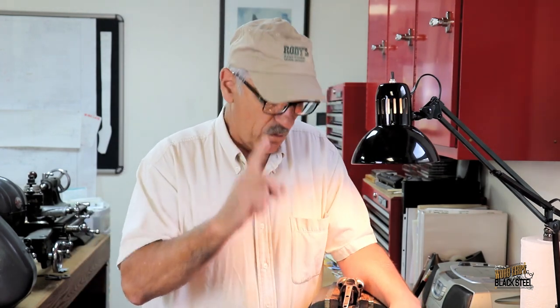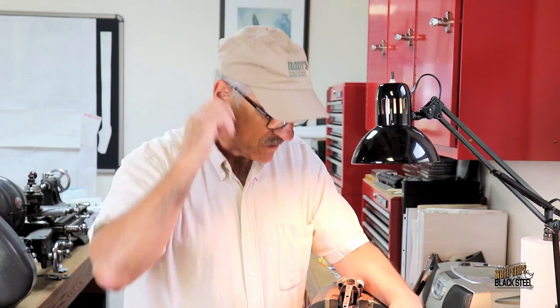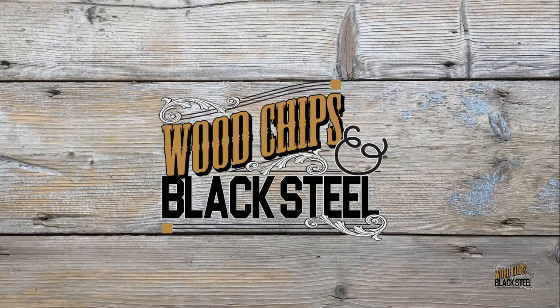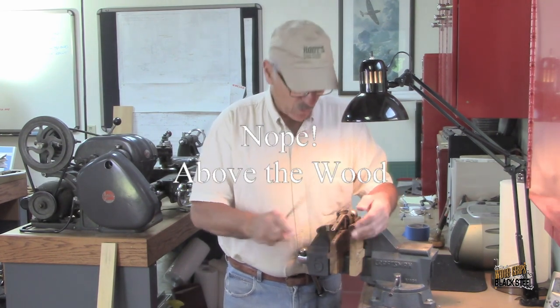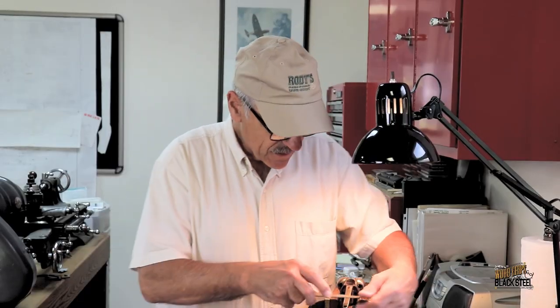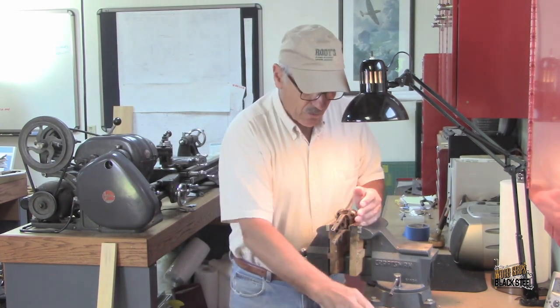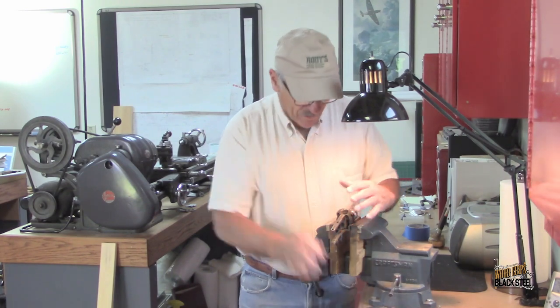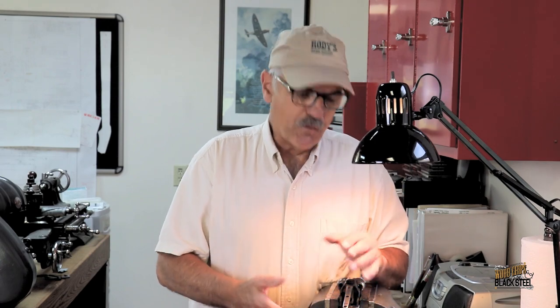I have a singular goal today and that is to get the first coat of finish on this buttstock that I've been working on for so many months now. The last thing I need to do is polish down the parts of the metal that are actually slightly below the wood, because we're trying to get a match finish. We're talking a couple of thousandths, but I want to get the section around the inlettings matched to the wood itself so I can get that first coat of finish on. Once I've got this matched, I'm confident I can start the final polishing process without worrying about mismatching or getting the metal too far below the wood.